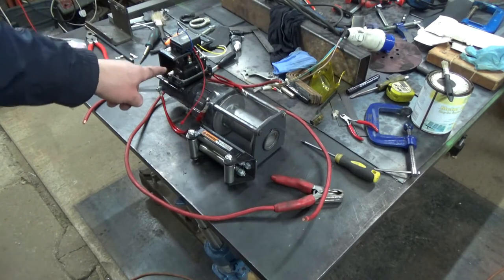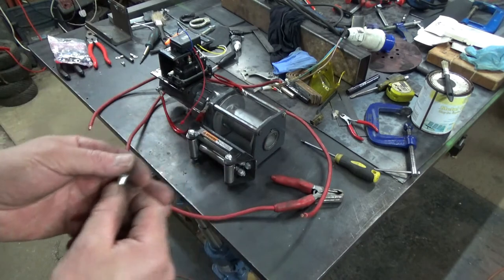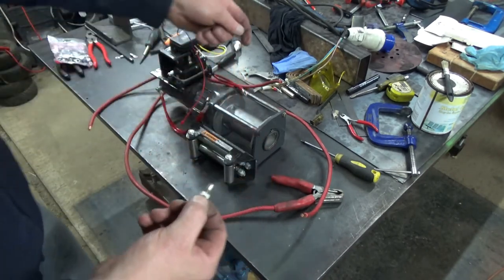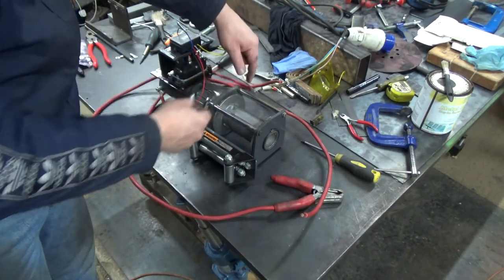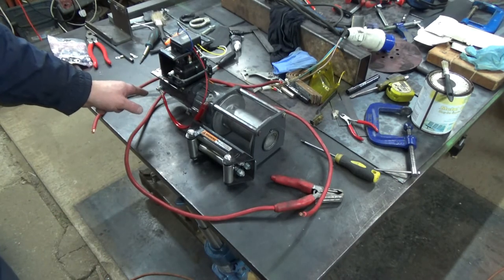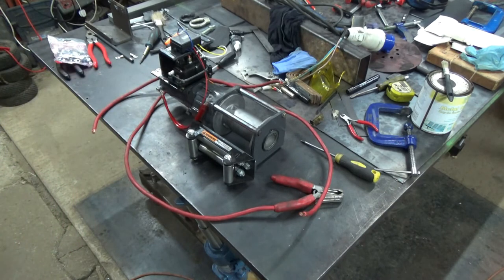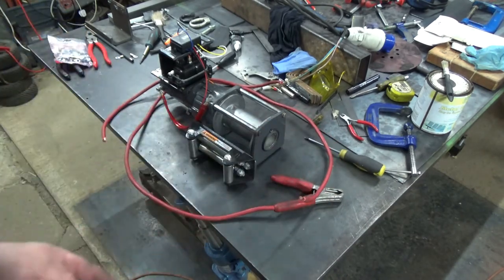The relay in there has 6mm terminals. Now I've just been down to buy some, and they fit this nicely. I've just used 4 to make these 2 cables up, which go from the relay to the motor. Both these cables are thicker than the cables to the brushes inside, so they're ample, and these are easily ample but longer, so there we go.